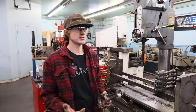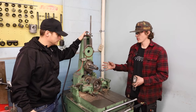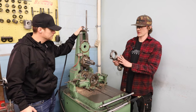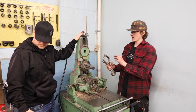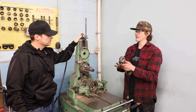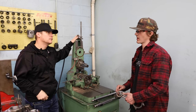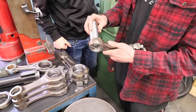If you are not swedging these bushings you are just not doing it correctly. This is our bushing boring machine — I'm going to show you how we cut the bushings to the right clearance. What's cool about this machine is it sets off the standard rod length, so when I cut that bushing it's going to put it perfectly center-to-center on those two holes — giving you your right length spec. The bushing has to be bored to size; it's not ready to go as pressed in. I have a wrist pin right here and as you can see it doesn't even go in — it needs to be bored to size.